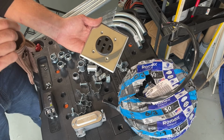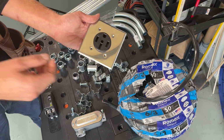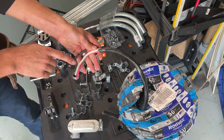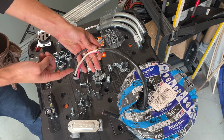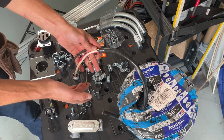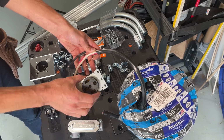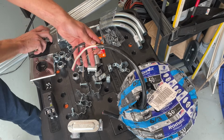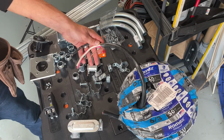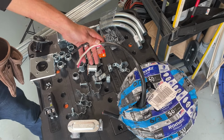In the description, we're going to include a complete material list with links to make your shopping easier. For this project, we're utilizing 6/3 Romex or non-metallic cable. The Romex is equipped with two hots, a neutral, and a ground, each one matching up to a specific terminal on your NEMA 14-50 outlet. Romex is the standard wiring method for residences, and it's going to be one of your most cost-effective wiring methods.